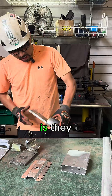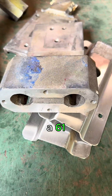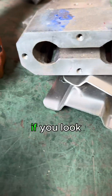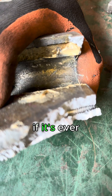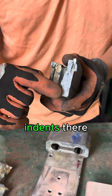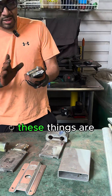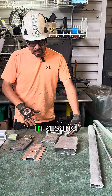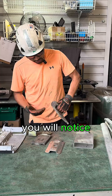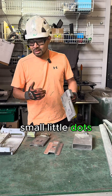The other part is they will bring something in like this — it's very heavy duty. You would think it was a 6061, but unfortunately it's not. It's cast aluminum. If you look on the inside of it, if it's ever crushed, you can always hit it with a hammer. You'll notice all these little indents — those are impurities, things like zinc that get attached. These things are tossed in a sand mold and made this way. You'll notice small engravings, small little dots, those kind of things.